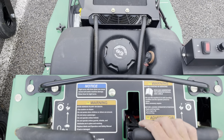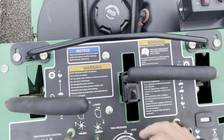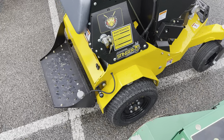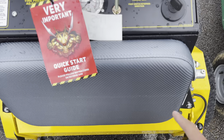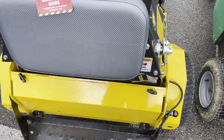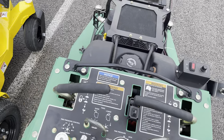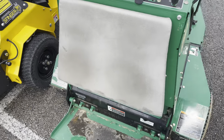With this one, you're less likely to accidentally put the tines down while going on the road because your hands are occupied. If I had to choose, I like the Stinger setup, because with Stinger you can customize the control so pressing the pedal either raises or lowers the tines, and then you can shut the whole thing off so you don't accidentally put them down while transporting. Toro, you couldn't do that. So if I had to go foot control, go with Stinger, and if you don't have Stinger in your area, go with Ryan.